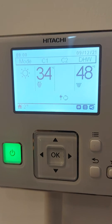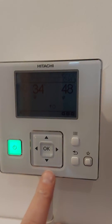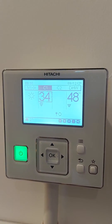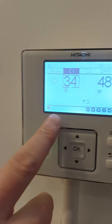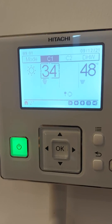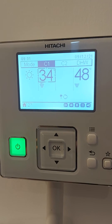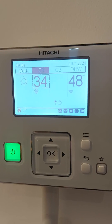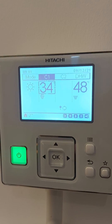The time and date is at the top. If you get a fault alarm, this green button goes red at the bottom left, and you get a fault code coming up at the very bottom. Common faults with the Hitachi would be 070, which could indicate a pressure drop in the heating system — where it goes below one bar pressure — or you could have a blocked filter inside the heat pump.